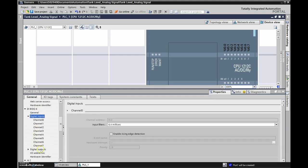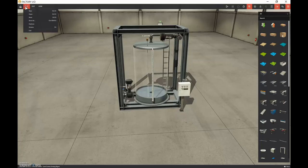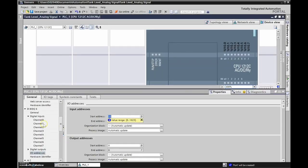For inputs, I have addresses here. We're going to start the addresses at 10, offsetting each of the physical inputs so that Factory IO can work. Now looking at Factory IO under File > Drivers, we can see the level meter is ID 100 and it's a real value, so our analog values are going to start at 100.